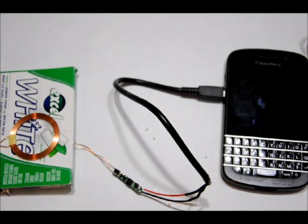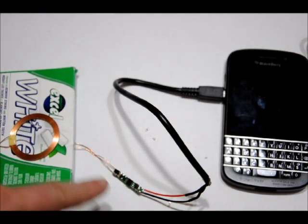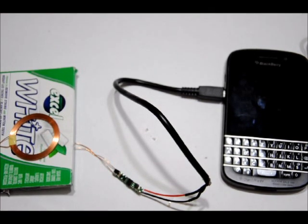The power will effectively cut off between the transmitter and the receiver at about a centimeter — not that it cuts off exactly, but I won't have enough current to transfer between the transmitter and receiver coil, and so the phone will wake up and say it's not charging anymore. Anyhow, I just wanted to show that off. I've got 12 volts on the transmitter, and the receiver is connected directly to a micro USB connector that is powering my phone right now. Thanks for watching — I hope you enjoy the video.